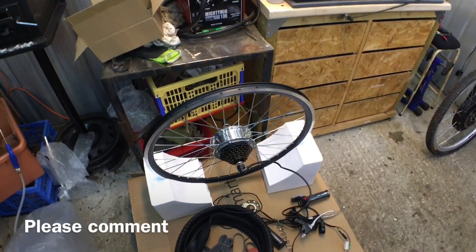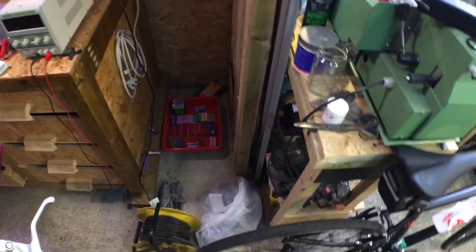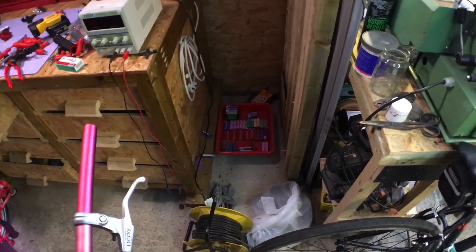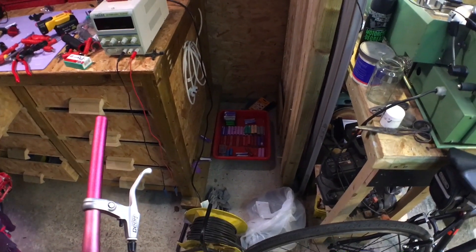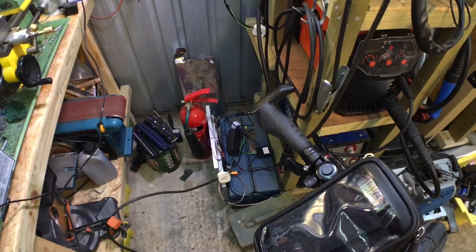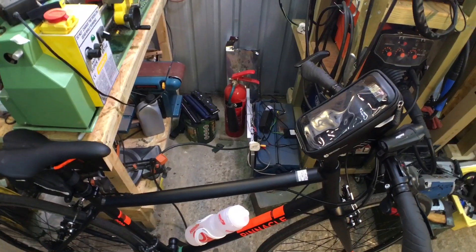Battery-wise, I did buy a load of batteries off eBay and wasted my time. Some of them were still kind of usable but not good enough for an e-bike battery — okay for a torch maybe. I got literally 20 batteries which were over 2 amp hours, but after a couple of days they'd drop right down from 4.2 volts to about 3.9 volts, so it's not even worth using them. I still haven't split some of the packs open yet.